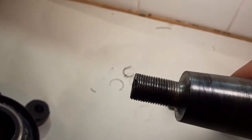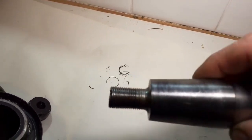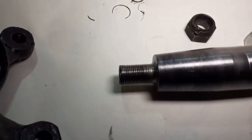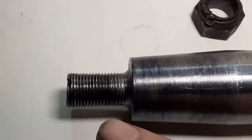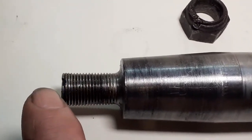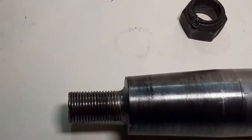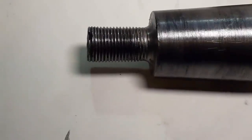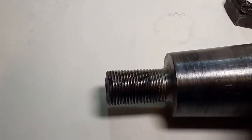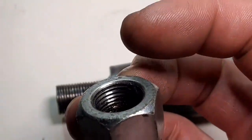There's a piece missing there. It's kicked up very slightly over there — the threads here are wider than those. It's just mangled. On initial inspection it doesn't look too bad, but it's the other side. It just kicks up over there and there's no way you can get the nut back on — it's ripping the thread out. One side of the thread's okay, but then on the other side it's pulling it out. It's about 50% smooth. You can see that nut's not happy. That's not going to survive.